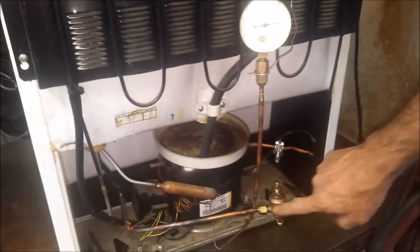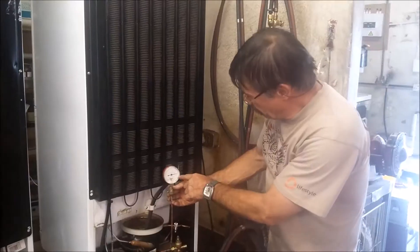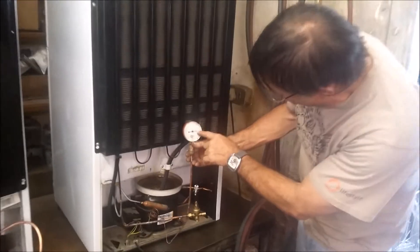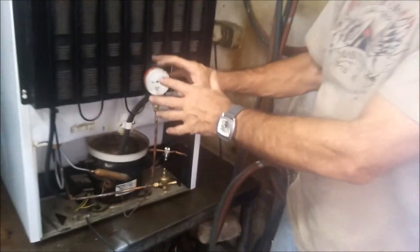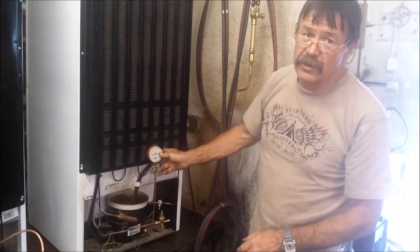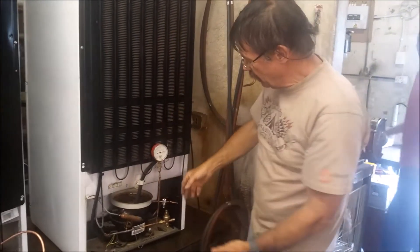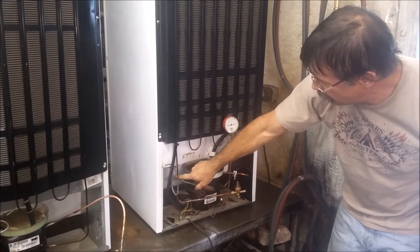We put a valve on here and pump this up under pressure with a gauge. This gauge is marked in PSI and we've got it to about 340 PSI here, which is quite a high pressure. We've sealed this side off and we leave it for at least 12 hours. If you come back in 12 hours and the pressure is still the same, you can safely say it's not leaking inside on the suction. It also has two internal condenser tubes — these two silver ones here.